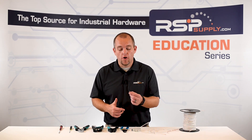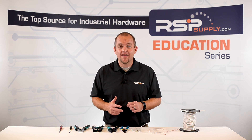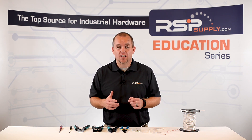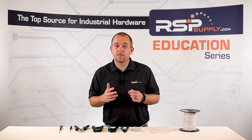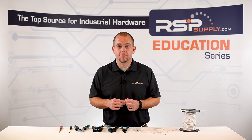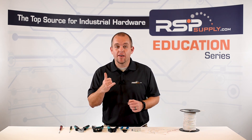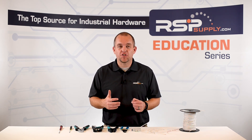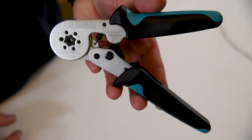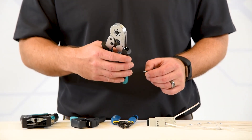The next way we can prepare a wire is by using a ferrule, which is a connector that is crimped onto the end of the wire. This eliminates any risk of fraying or birdcaging, giving us the best protection for the actual electrical connection. The one drawback of using ferrules is cost — they do cost more than tinning or the other methods we've already talked about. It is important to keep in mind that we need the proper tools to make the crimp, either a ferrule crimper or some sort of combination crimp device. The ferrule crimper simply crimps the ferrule onto the wire connection itself — it does not cut, strip, or twist the wire.